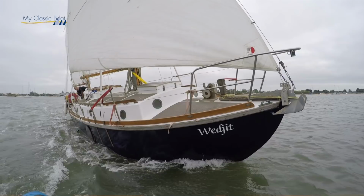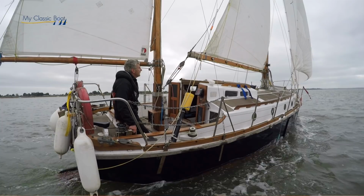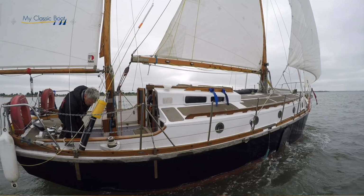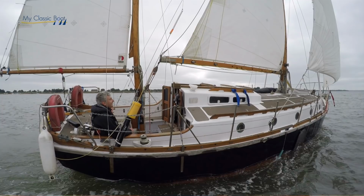But does having leeboards make it more difficult to sail? Or more work? I mean, the leeboards are only plate steel, which is the way they were designed. And they're simple, and they're bolted through the top sides. They're not like a barge where it's from deck level, which in some ways makes them more convenient, but you've got to make sure the bolts don't leak, which a friend helped me redesign, and we don't have any leaking there.